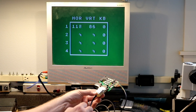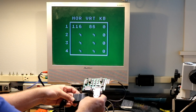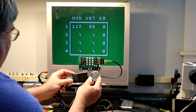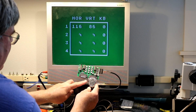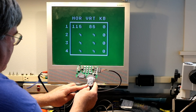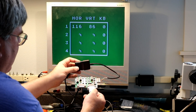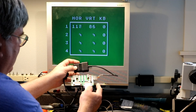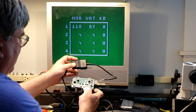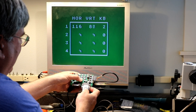I have come up with a circuit — I'll go into detail on this later. Right now I'm just going to do the demo part. You can see there's a board here; this silver connector is going off to the Atari 5200 standard 15-pin connector. And over here we have a connector for a PS2 joystick — I just cut this off of a PS2 extension cord. And we've got a keypad here.